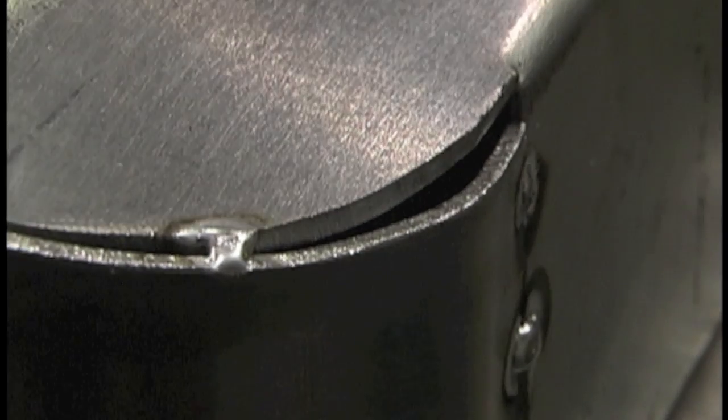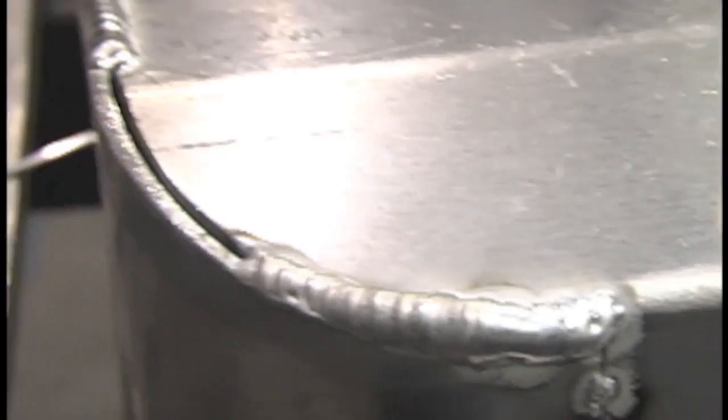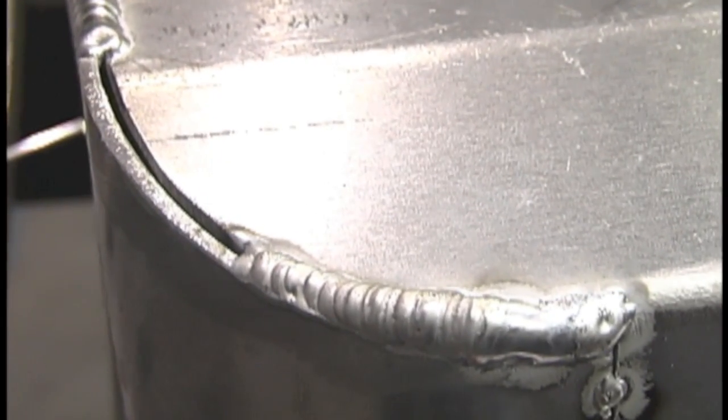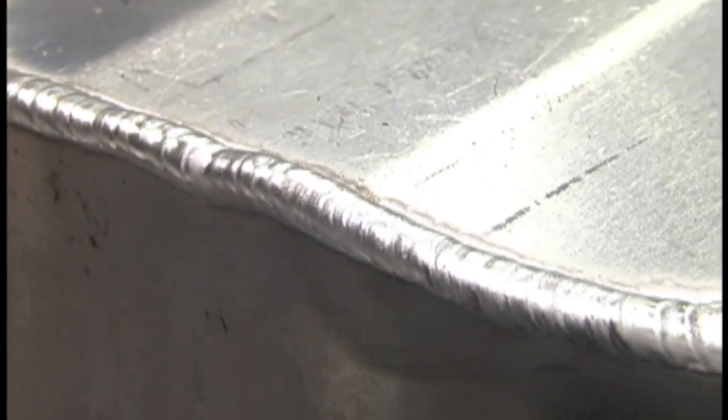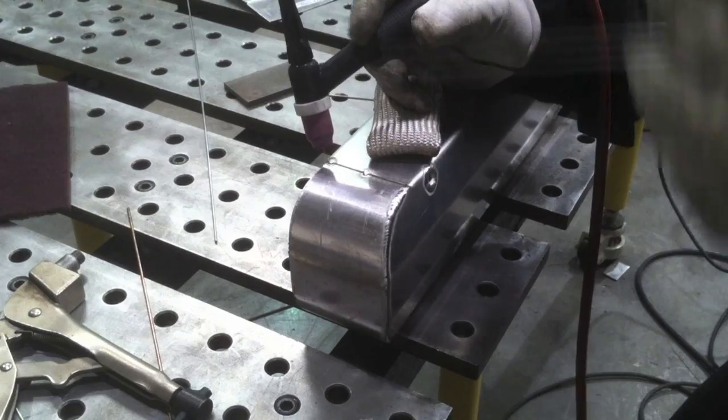Now that's a pretty good little gap right there — well over the diameter of a rod, a good 3/32nd gap. Sometimes on gaps like that, if you want the end product to look pretty decent, you can just fill the gap in really cold. It doesn't matter what it looks like at that point. I'm using 1/16th filler here and I'll just weld right up to it where I've got decent fit-up. Then when I get to that point where the weld is ugly, I'll stop adding rod and just pulse manually with the foot pedal, trying to put some ripples in there that look a lot like the rest of the weld. It doesn't look all that weird — it looks better, that's for sure.